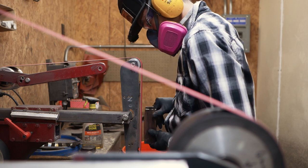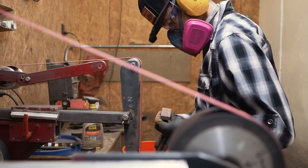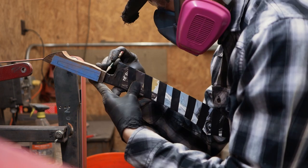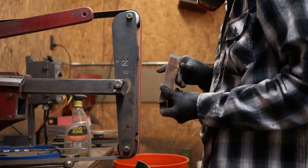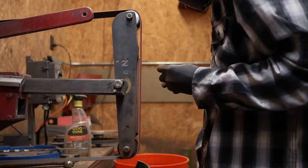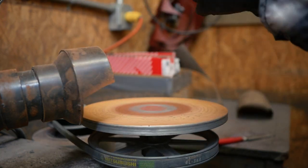The handle itself is pretty minimal with just a few curves to complement the profile of the design. For me, flat surfaces and straight lines are way easier — curves are doable, they just need a little touching up afterwards. I make sure to have everything squared off and then draw the center lines down the handle. Shaping the rest is pretty easy — center lines first, then shape the rest. I do these handles in sections: the front and then the back. It's easier for me to isolate the parts and make things comfortable and symmetrical. Most of the shaping is done on the grinder, then I get the faces cleaned up on the disc sander and glue the handle permanently.